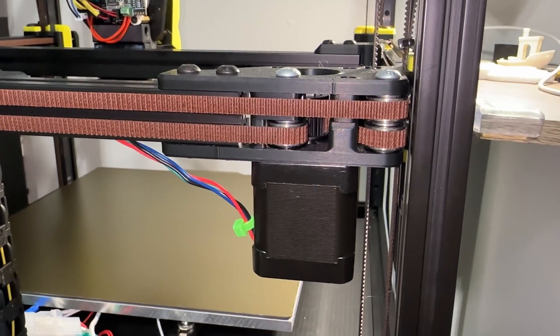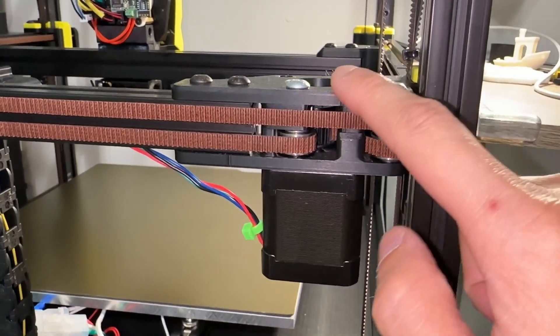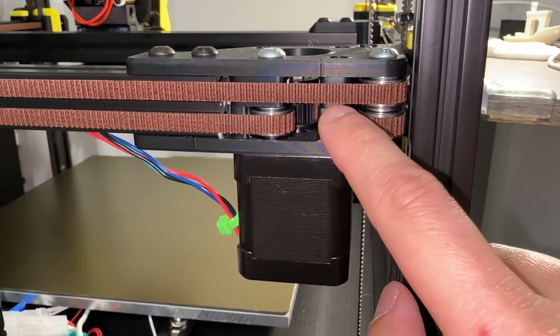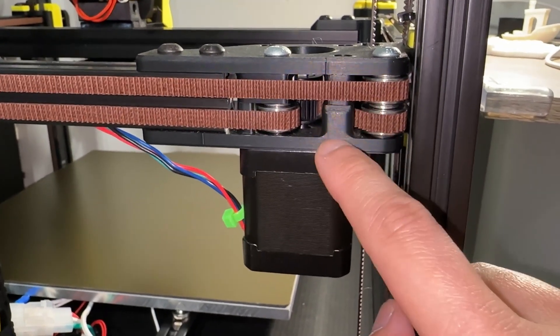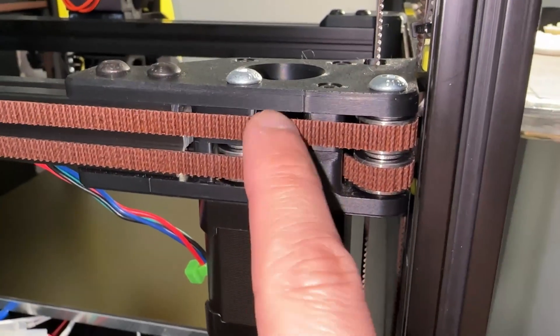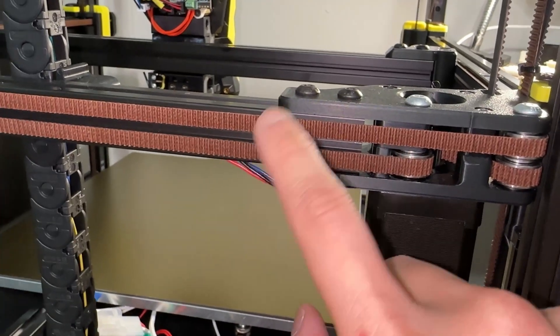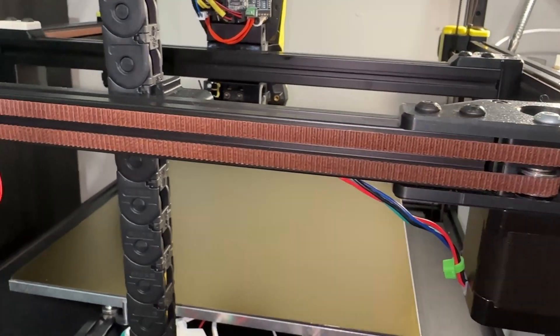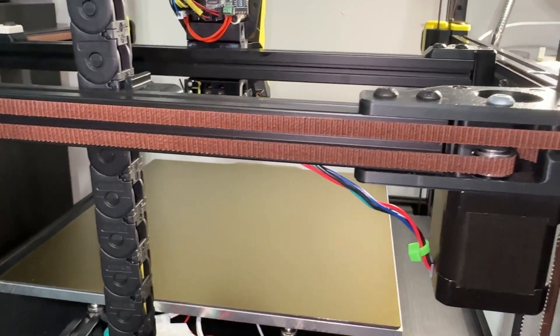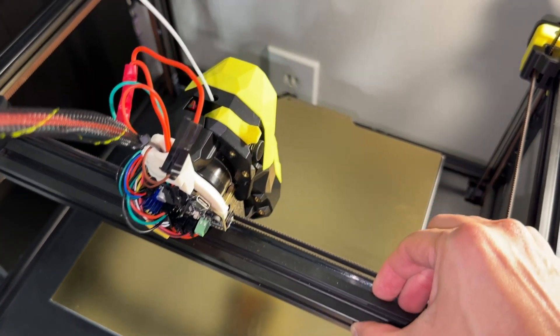The seventh video was assembling A and B drives, idlers, and belts. The big mistake is misrouting the A and B belts, which is more likely than you think. The belt may miss a pulley, snag on plastic, get pinched, or simply be off. Once routed, both belts are cut flush for equal tension. But if one belt is routed differently due to careless mistakes, it's not quite equal anymore — this can cause all sorts of weird movement patterns.